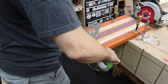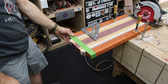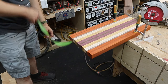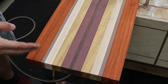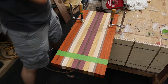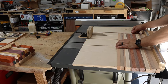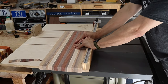If you don't have a table saw, the best way I've found to square things up is to use your circular saw and a speed square. Put down some painter's tape to prevent any tear-out from the blade, then remove the tape. If there's a gap where you didn't get a good clamp, cut that off — you don't want to leave that in your cutting board. On the other three boards, I used my crosscut sled and the table saw to cut them square. I've got a video on how to build that crosscut sled — I'll put a link in the description.